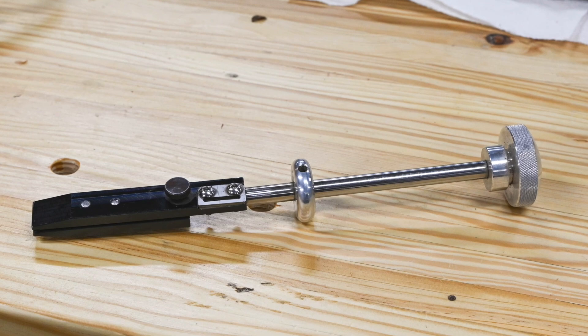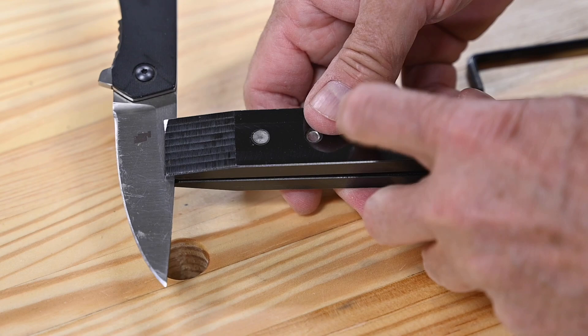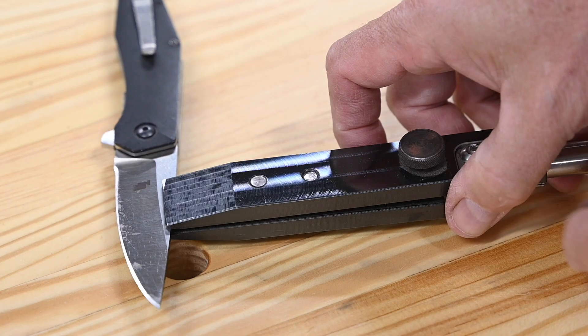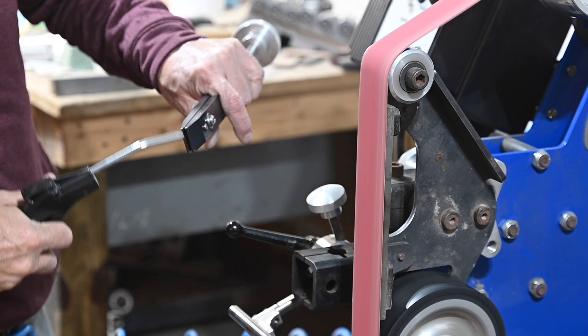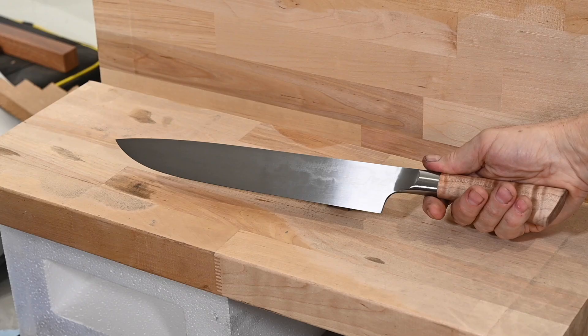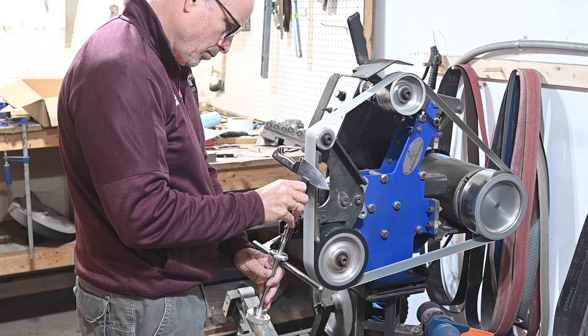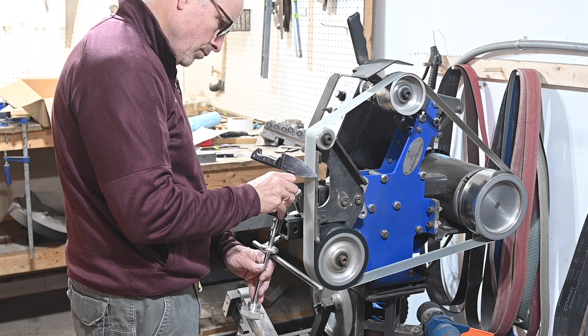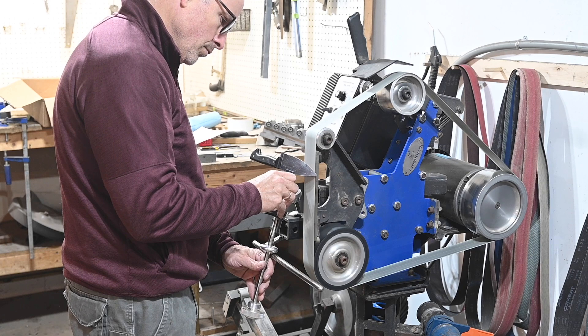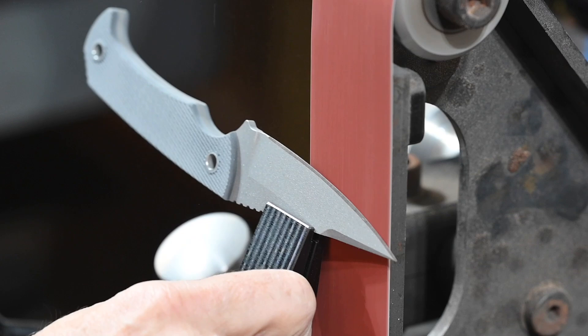You might look at this and think the little clamp will scratch up your knives. In my experience it doesn't, if you're careful. But if you yank stuff in and out of that clamp, yeah, it's going to leave tiny little scratch marks. I regularly blow out the business end of the clamp with compressed air to make sure abrasives or crud aren't trapped in the jaw, or I clean it out with a paper towel. Now, what if I'm doing a 'suicide knife' — that's my term for a knife that you've put so much time into that if anything goes wrong, you feel like committing suicide? If I'm sharpening a Damascus blade that I've etched, polished, and put dozens of hours into, I'll throw a little auto body masking tape on the spine of the blade, tighten it nice and tight, and there's zero chance of marring the blade. For my production stuff I don't do that, and I rarely ever have problems.